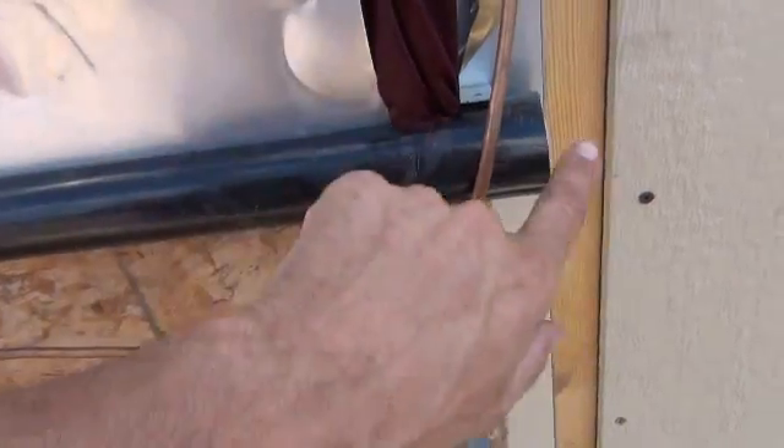This overfill tube you're looking at here comes through the bucket and into the bottom piece of PVC pipe. Now to make the catches in these pieces of PVC pipe, first of all, I had to cap the ends of them off. There's a wooden plug in there and then some silicone.